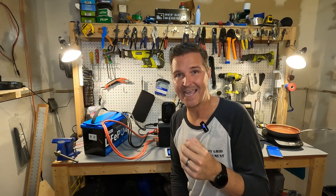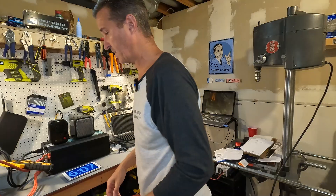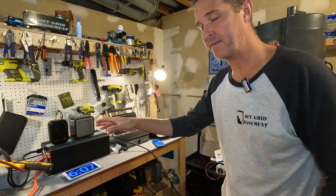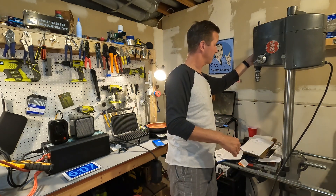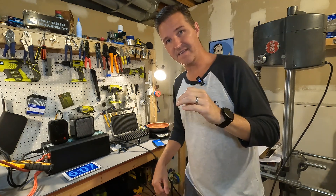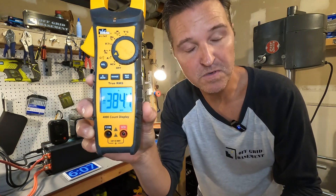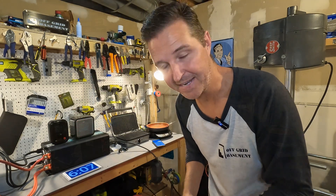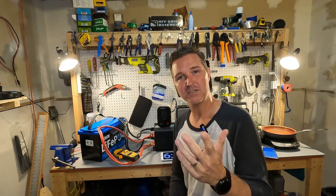I'm pretty impressed with the programming this battery has. The safety features are real tight and I don't mind that one bit. When your documentation says 100 amp continuous maximum, you really shouldn't have much more than that. I like the fact that at 120 amps it shut off after 10 seconds, and it did give us 270 amps for 10 seconds before shutting off. Now the question is whether it can power my ShopSmith, which pushes like 400 amps for just a second and then runs at about 80 amps. With an amp clamp on the battery cabling, I clicked it on — it ran for half a second but couldn't sustain it. The amp surge, however, was 384 amps, so it was able to do that for a split second.